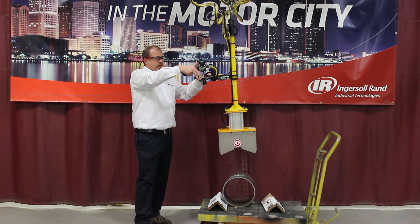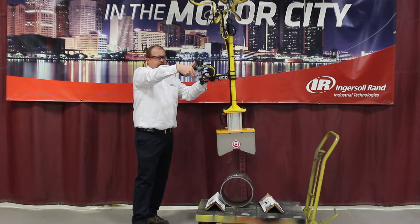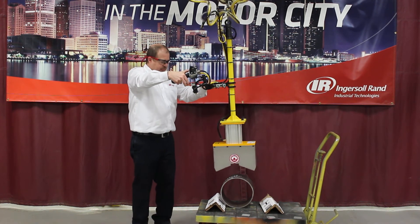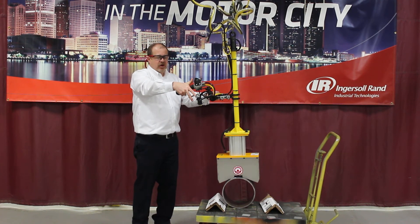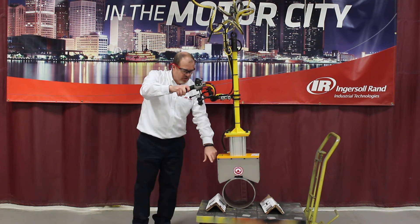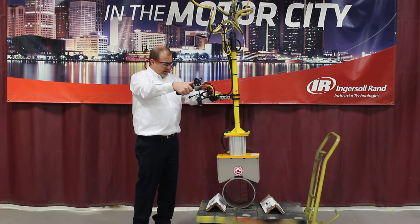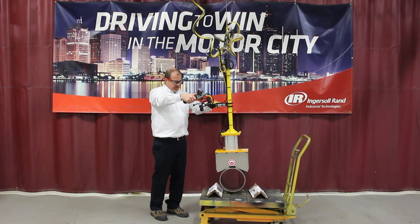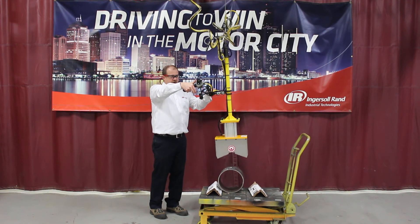Or, the operator, when he goes to pick up the part, can deactivate the magnet first. That way, I can spot the magnet to the part. If I do it that way, I'm going to need to let go and wait a couple seconds to allow the rare earth magnet to go ahead and energize to the part, and then I can go ahead and lift it like before. The drop-off is the same — lower down, make sure my interlock is shifted, and then release off the part.